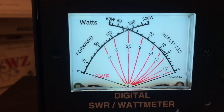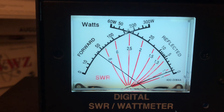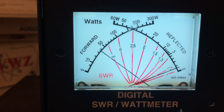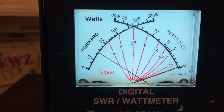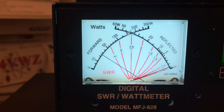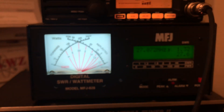On the 250-watt scale — pay attention to the needle. Audio check, one two three four, one two three four. Right about there — I'd trust it right about there: around 20 to 25 watts on AM. Not bad at all, and that's with the PEP scale.